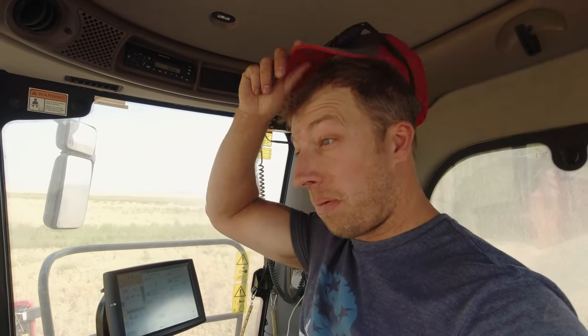So we're going to have to be dragging headers on the ground, but we rolled it. These are not flex heads, but we're going to make them be flex heads. It's going. It's really cleaning the tank — not many pods in there, not many shells, so that's doing a good job. My tailings showing a little bit of loss, and my sieve loss is fairly high. Went out back — there's some pods getting kicked out that aren't being threshed.